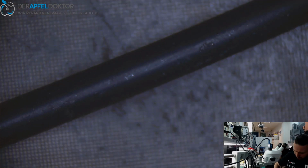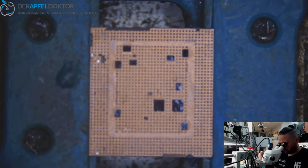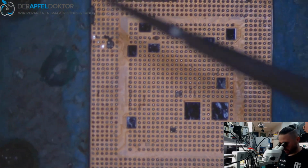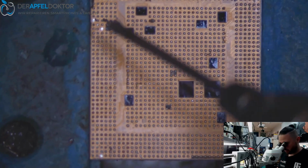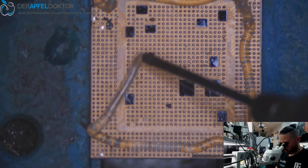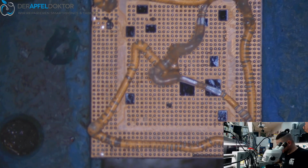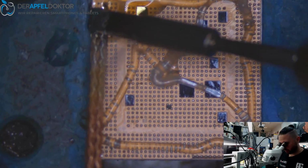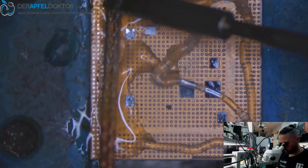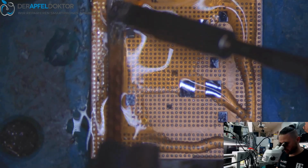And now it's all about cleaning the CPU, and we don't need to do much here because the CPU has only a little bit of glue on it. And you see that we had some cold solder here. And you can see the cold solder areas really good because it's here, here, here. We just were disconnected in these areas, okay? So it's all about taking enough flux, fresh wick and solder. You can see here how easy the glue goes away. That's just an overheated CPU.